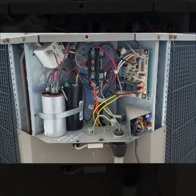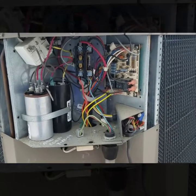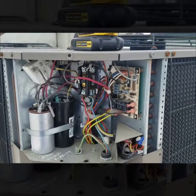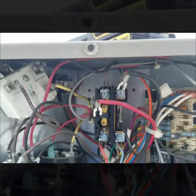I'll confirm it — we have a bad compressor. I just shut power off to the system and pulled my leads going to my compressor: my run, start, and common wires going to the compressor.